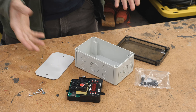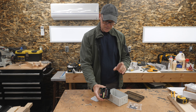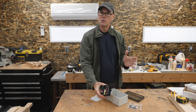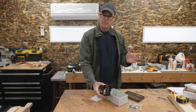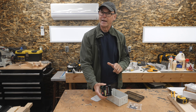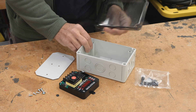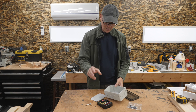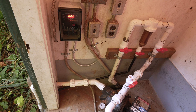It's a couple of weeks later and I have another option. I have a motor controller or sensor that's going to be wired between the electrical panel and the motor, and this will shut the power off to the motor when the well runs dry. When the pump is running under load pumping water, it's drawing a certain amount of current in amps. If the well runs dry and there's no water circulating through the pump, the amperage drops significantly, and this sensor reads that drop and should shut off the pump. I want to install the sensor in this electrical box, mount it on the wall at the pump house, and wire it from the panel through the sensor to the motor.